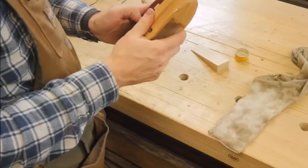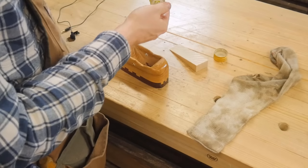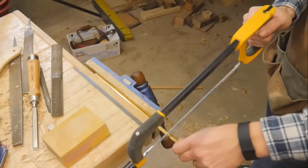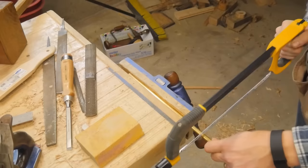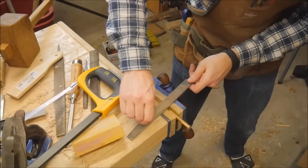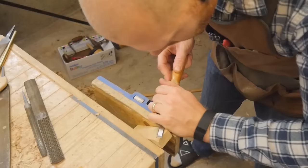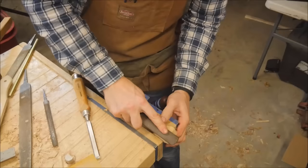I'm not going to any particular pattern — I'm just going with what actually feels good in my hand. This is a little trick I learned a while ago: I use some olive oil on the surface. Not as a finish, but it allows me to see what the finish might look like. It'll also raise the grain a little bit, and I can see if there's any nicks or scratches that need to be filed out. The pin is made from 3/8 inch brass, and I just cut it to length. I made it a quarter inch longer than the plane is wide, so that it buttons out a little bit on either side. Then just smoothed out either end with a file and gave it a nice shiny finish. I really do like the brass.